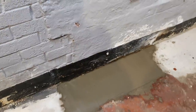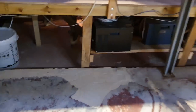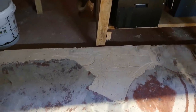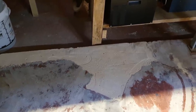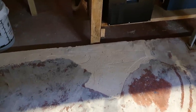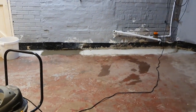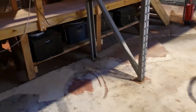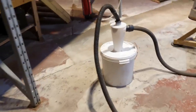Unfortunately, when we removed this cabinet I found a bit of cement that we didn't patch up when we did this section, so that's been filled — it just means it's going to delay us laying the first coat of primer down. The only thing I'm not sure about is this piece of concrete over here — that was a patchwork done when we moved in. You can see the circular marks in there — it's a really, really sandy mix. I'm kind of reluctant to pull it out. It is out of the way, and because it's under the racking and not going to be exposed to any foot traffic, I think we're going to leave it and just hit it with a deep penetrating primer.